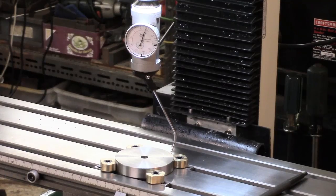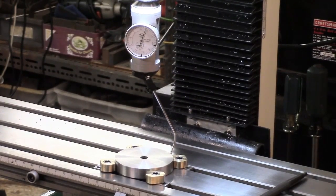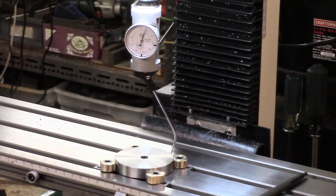Unfortunately, I've still only got my half-inch roughing mill — I'm hoping to get a three-quarter at some point. So I'll probably have to take three passes, and again it's not super critical, although I want the one-inch bar to fit fairly well. So we'll see how we go, I'll get set up for that.